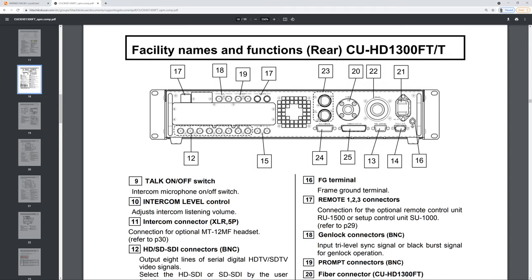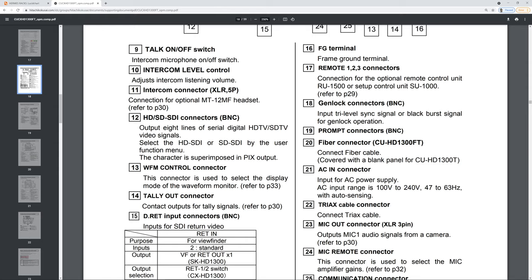My initial design didn't really accommodate for the other method of changing settings in the CCU, which is the PIX output of the unit itself. Even though the PIX output is essentially a carbon copy of the other HD-SDI outputs of the camera, the only difference is that it has the ability to superimpose the menu over top of that output. It's not uncommon for people to run that output straight into their video switcher or router — however, the inherent risk is that you could be live on that camera and the menu could be brought up on air. I've actually seen this happen, and it's never fun.